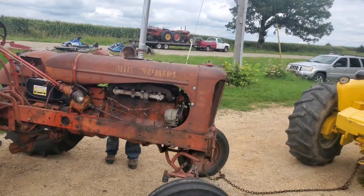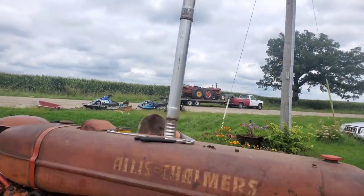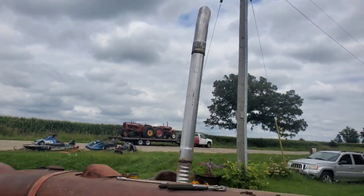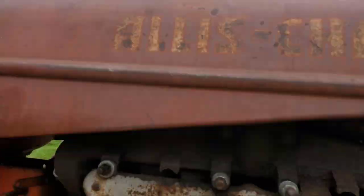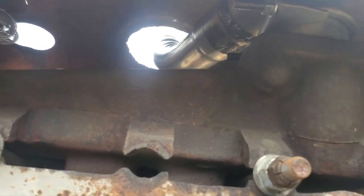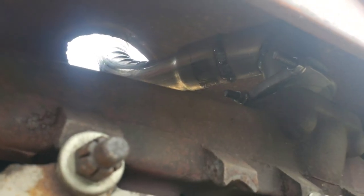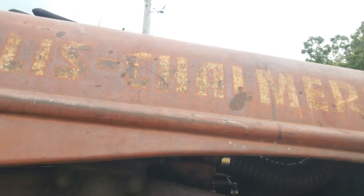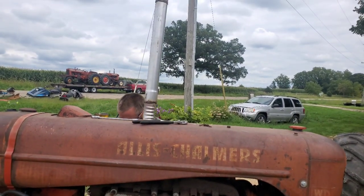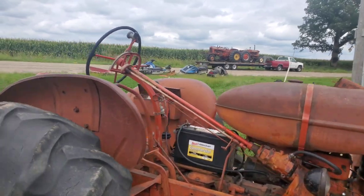It's a pretty cool looking tractor - just a diesel 45, pretty neat. Under the hood, the exhaust came up on the wrong side of the hood, of course. That's just a cheap pipe that we got at the parts store. Welded it together down here - we just made a 90 and called it good. Hopefully there's not too much back pressure there. They're supposed to have some back pressure with a muffler, so maybe I'm creating the right amount. I bet it runs fine.